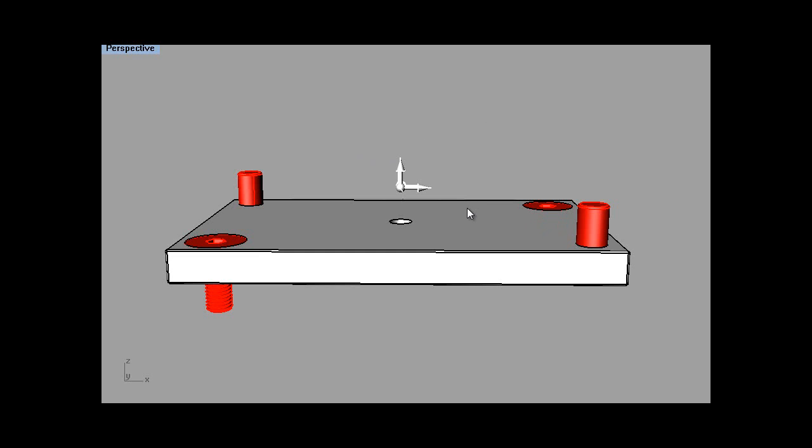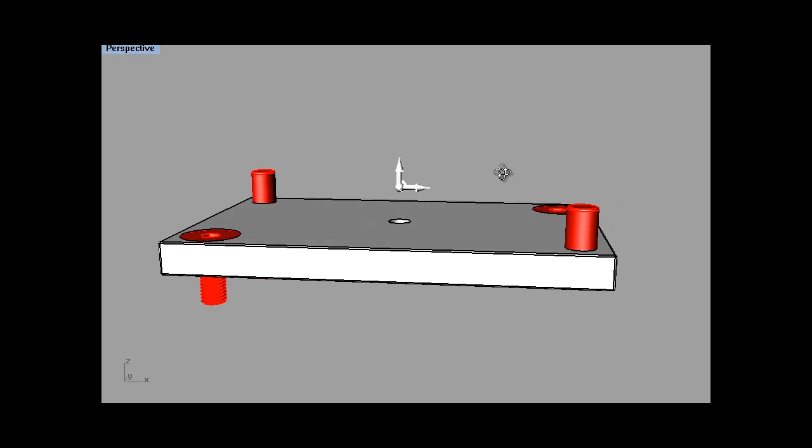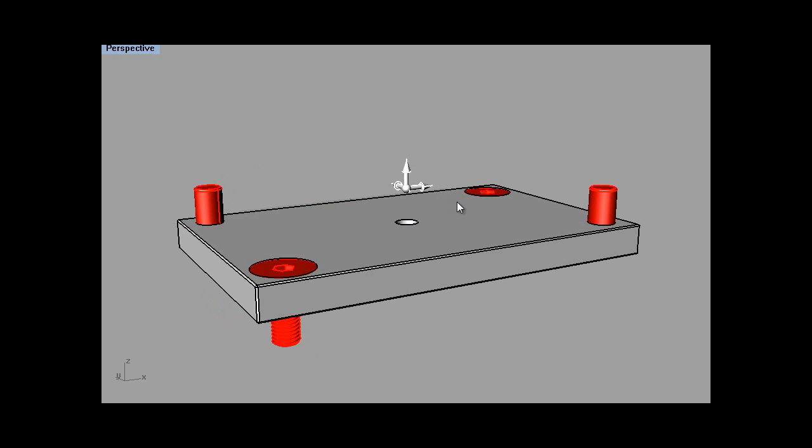Nip the spindle up, tighten the spindle up then, and then jog away. Well actually, when you've touched it, sorry, zero the Z axis first, so then jog up out of the way so it's safe out of the way. So that's given you, basically it's put the Z there and the X and the Y there.